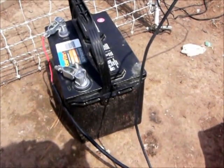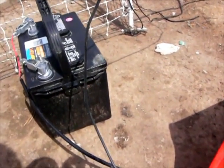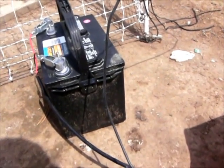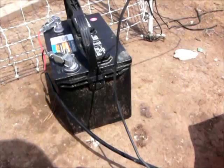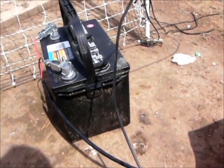This fence does get moved regularly. Every month or two I'll take the battery and charge it. When this fence is charged and working properly it will send out a 10,000-volt charge 40 times a minute, but it's an extremely short spark.